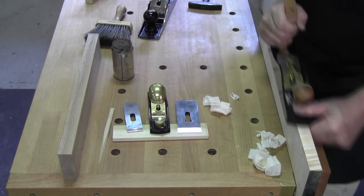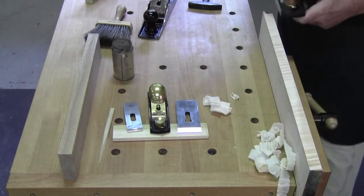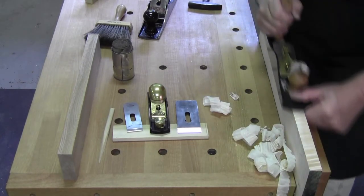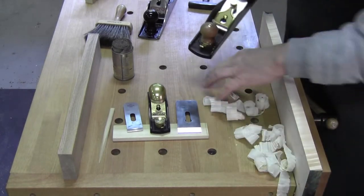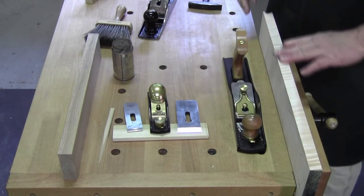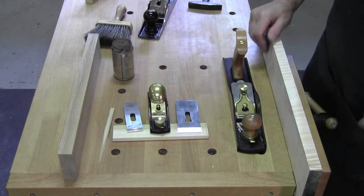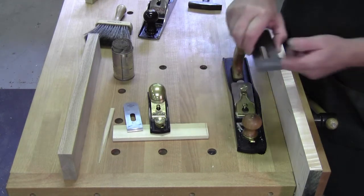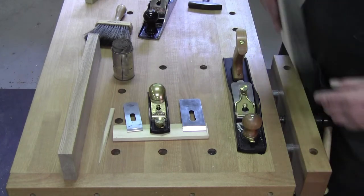If the wood is behaving, nice clear wood, straight grain, like I said before, you can plane that with a single blade plane, no chip breaker, all day long. And many people did. I mean, that's how the cathedrals and town halls and all sorts of places were built. They were built with blocks of wood with just a single blade in it, beveled down. They did have some that were bevel up, and they were mostly for planing end grain.